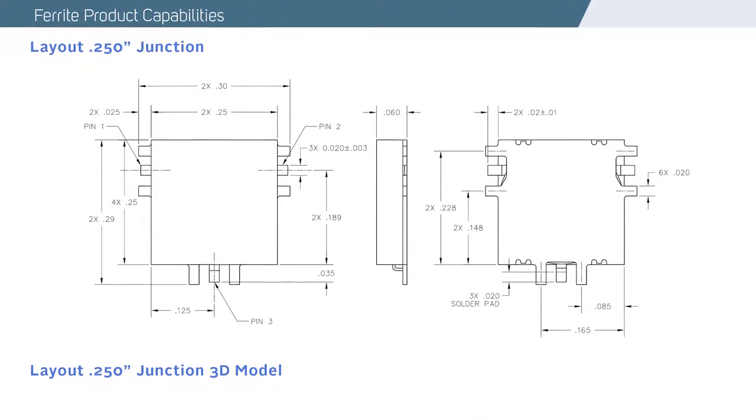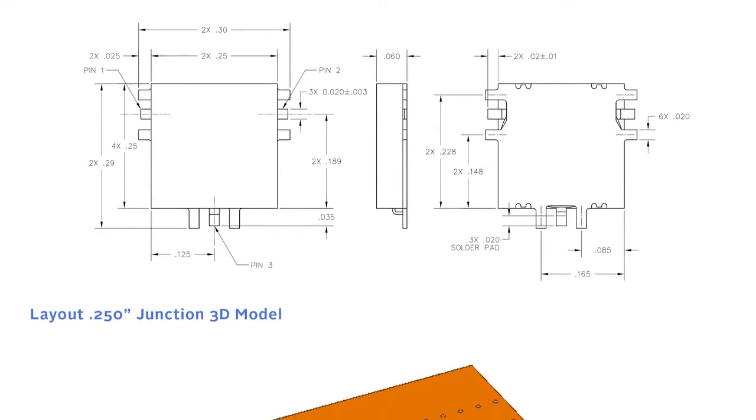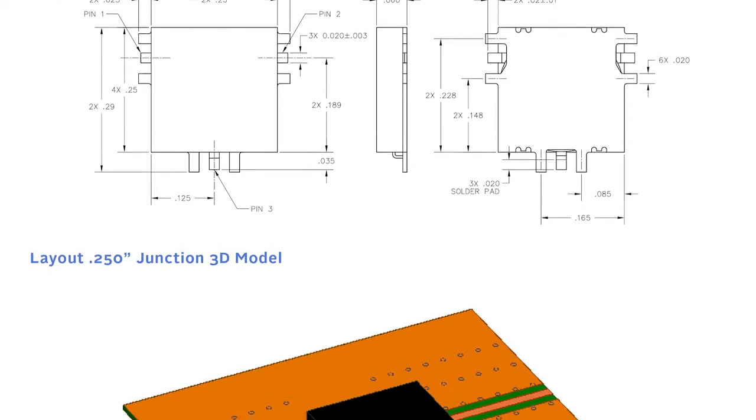Any particular challenge? Was it more of a packaging challenge? It's a packaging challenge. The actual electromagnetic simulation wasn't all that difficult. We use HFSS for that. The packaging, to get it in that small package, actually came down to choosing the right epoxies that can survive reflow temperatures. It's got a ground signal ground interface that is a better impedance matching for circuits.